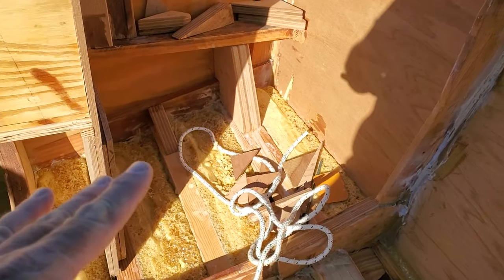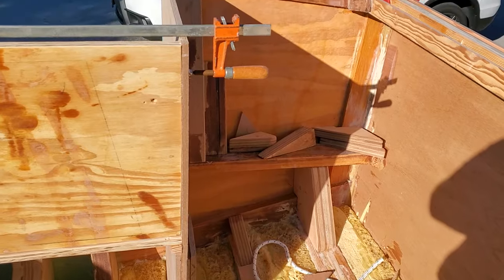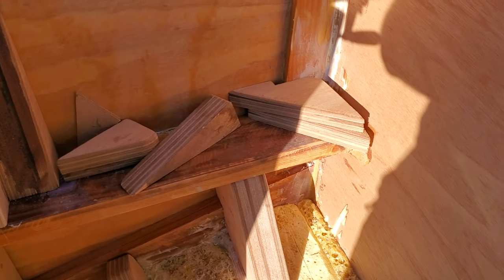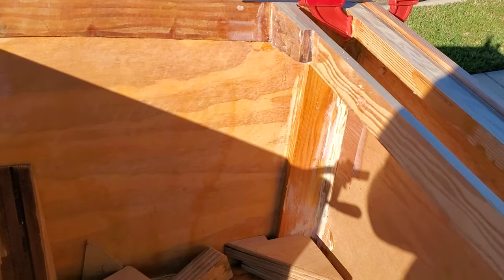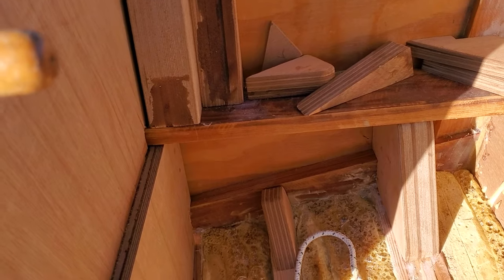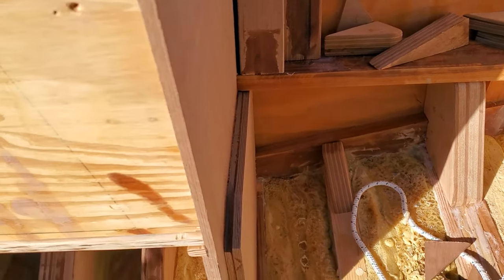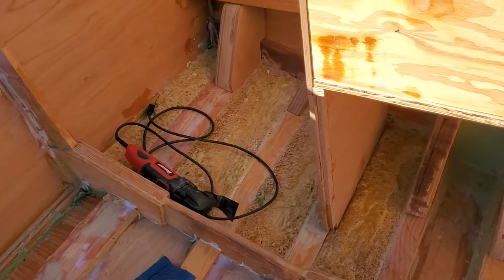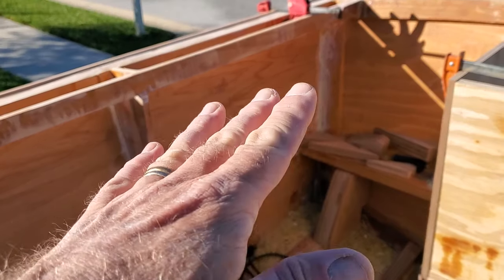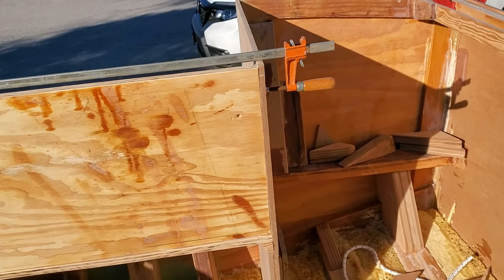If anything, this will have more of a chance to get wet than anything else. And I want to thank one of my viewers that talked about the corner braces. I'm sorry, I can't remember your name, but I'm still going to use those corner braces there, because as far as this transom goes, the main purpose is to keep that 2x6 beam across solid, attached to the transom frame and plywood, and the members that are all connecting to it, all the longitudinals, and then obviously the knee braces. So on this transom, it really doesn't need a beefy corner brace. It just needs a little brace, just for some added support.